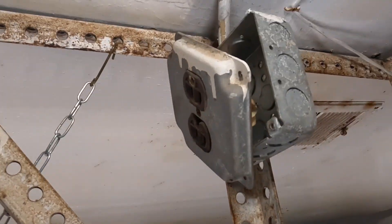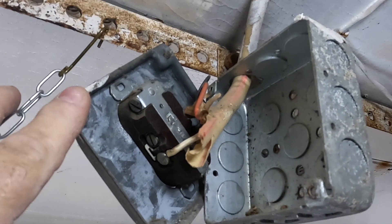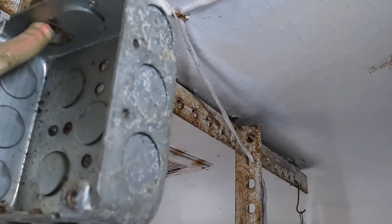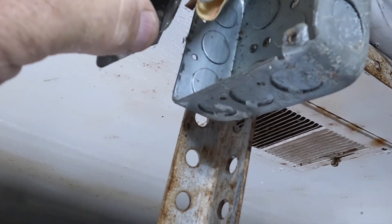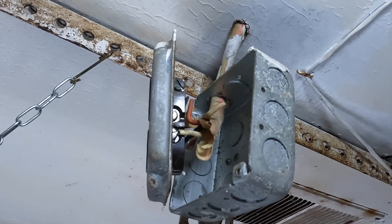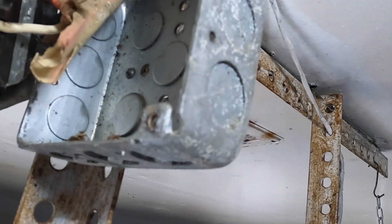Here's what I found. It's just coming right out of the ceiling there — not a big deal — but there's no connector going into the box. And then the length of the conductors is not adequate to work with. So that's another code violation, and then of course the red wire was just not used, as predicted.